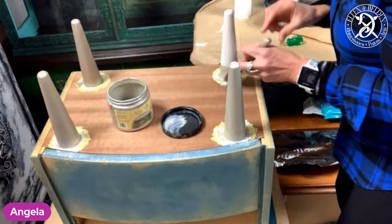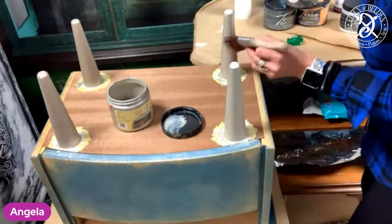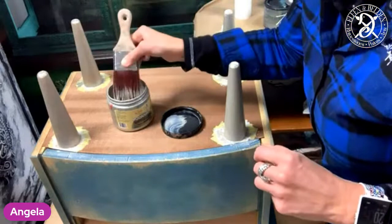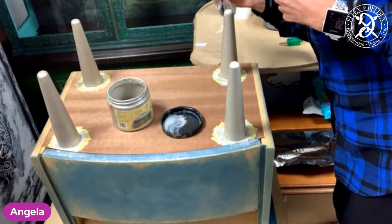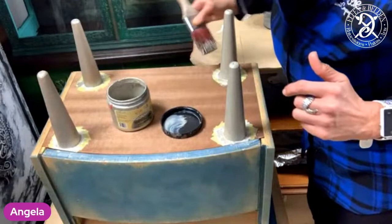I'll do that on the other leg. And yes, for a change, I taped around. They also have a self-leveling ability. If you paint with the Moonshine Metallics a bigger piece and you want to have a streak-free finish, make sure that you brush in only one direction. Don't brush forth and back. Just brush in one direction and that'll do the trick.